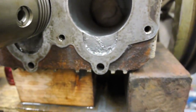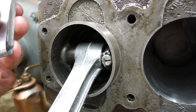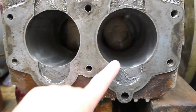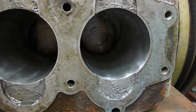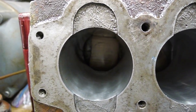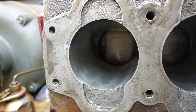Along the way you should grab your piston, make sure it fits in the hole, and check side-to-side clearances with a feeler gauge — Snap-on, Mac, whatever you have — and compare that to what Quincy recommends. In this case they recommend a 6 to 8 thousandths clearance. On this side I had a 3 thousandths feeler gauge on each side of the piston and it was starting to get tight, so it sounds like we're still in spec. On this cylinder we only have about 2.5 thousandths clearance on each side, so we're only going to take about 1 thousandth of an inch off with the hone.